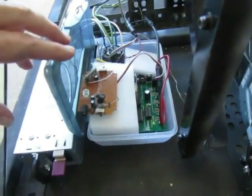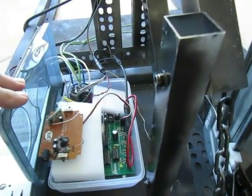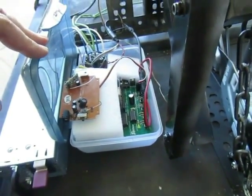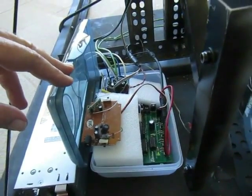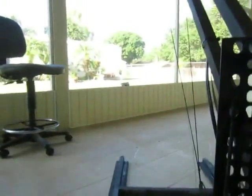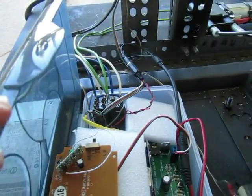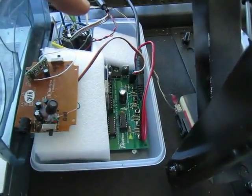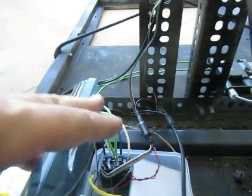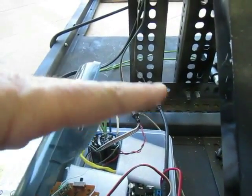This is a four-button learning controller, also referred to as the scuba-boo controller. It's four relays — you push the buttons to teach it. There's an MP3 player with ambient and scare tracks. This is from a Harbor Freight radio driveway alert that connects to a wireless PIR to trigger it. There are two relays doing the heavy lifting. There are some connectors here so I can isolate the power to the unit. A 5.5 millimeter connector allows me to disconnect the board easily, so the board can't energize the relays and I can disable the motor while working on it.